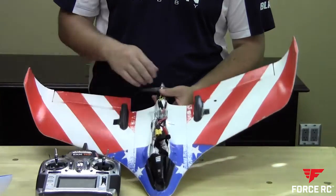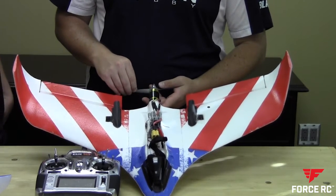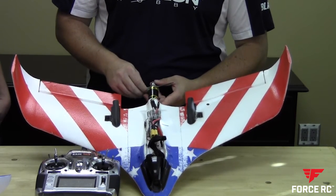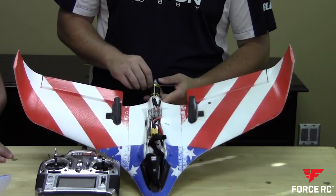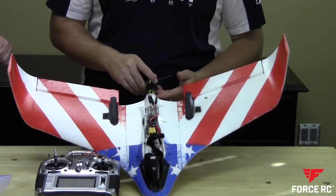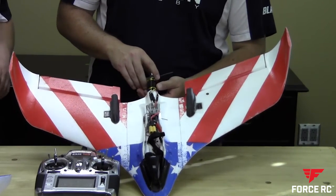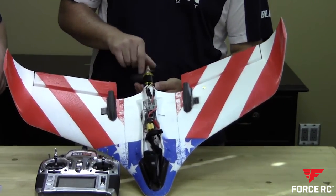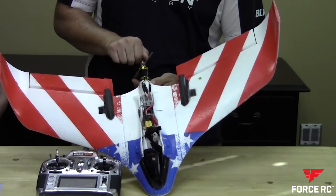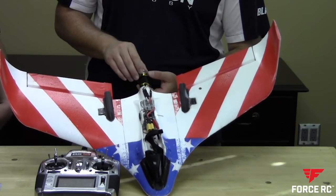Some questions afterwards were obviously what radio we used — DX18, both of us on the 18G2. What kind of speeds were we hitting? On a windy day our downwind passes were in the 150 mph range. Our average upwind-downwind was probably 125 to 130. So it's a very fast airframe, only pulling 40 to 45 amps, but we're doing about 770 watts. The limit at Worlds was 850 watts, so we're right up there. My airframe was actually clocked on the final race at 720 to 730 watts, so James had a little bit more speed on me. But it really comes down to flying — speed only makes some of the difference.